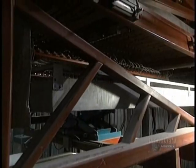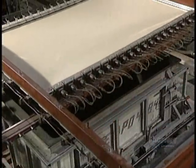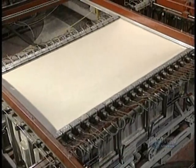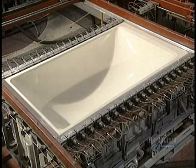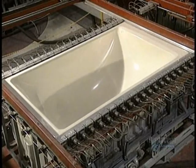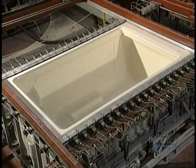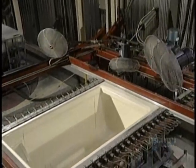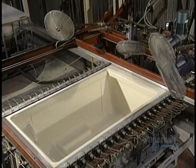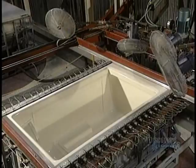Manufacturing begins with an acrylic sheet. It is heated to about 200 degrees centigrade with ceramic elements. The sheet becomes soft and malleable, so that it takes the form of the mold. Thousands of tiny holes in the shell suction the sheet by vacuum. The mold must cool before it can be opened; powerful ventilators blow air directly onto the mold, lowering the temperature to 77 degrees in 4 to 6 minutes.